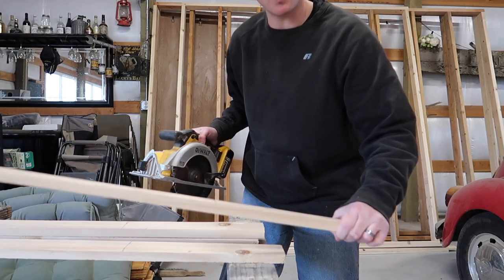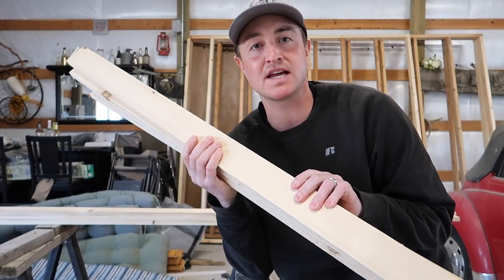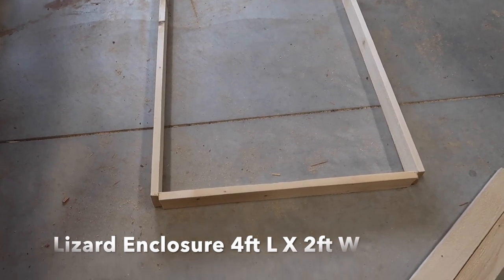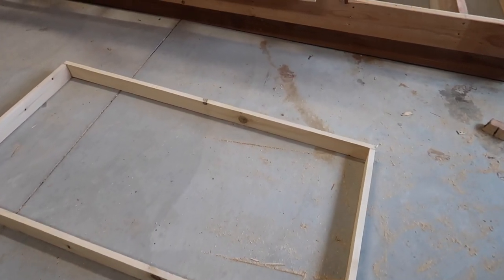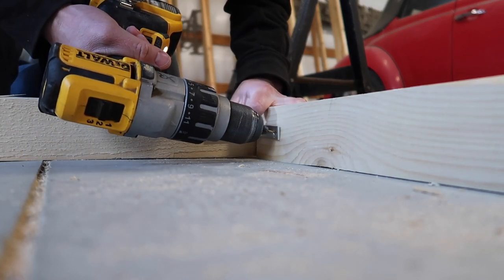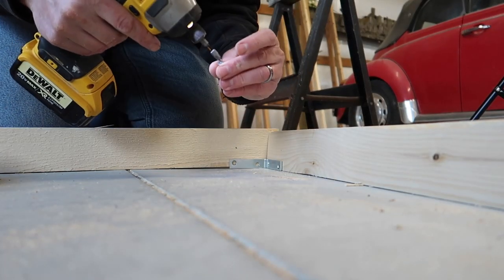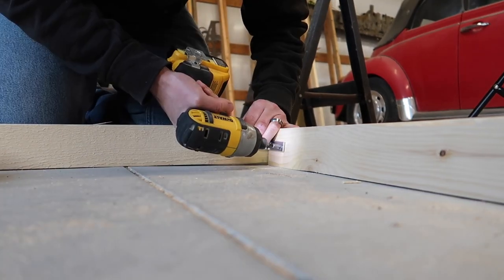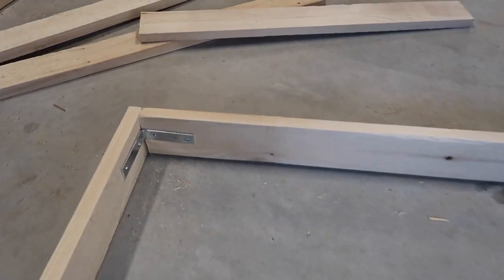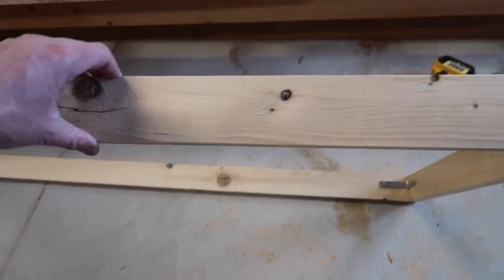We're going to make this about two feet wide. I got my four-foot sections and I'm going to put them together using the L brackets and the screws. The enclosure will be four feet long by two feet wide — plenty of room. I always like laying the wood out before I start drilling to get an idea of the actual frame. I'm going to go ahead and pre-drill these holes — it'll make it a lot easier and so the wood will not split. I'll use my other drill to put the screw in to tie down what I just pre-drilled. Frame one is now complete.